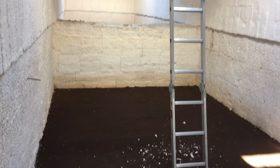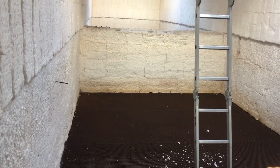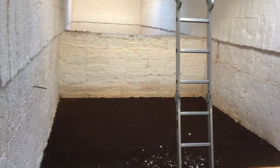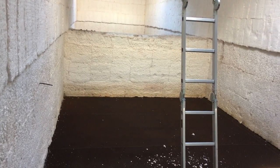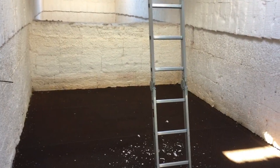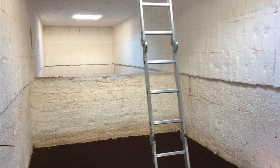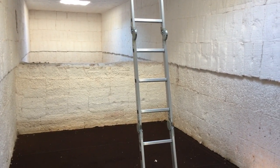In this bed, as you're looking, there's no ceramic media here, but right about that ridge along the width and length of it is where the ceramic media bed would be up to that level. It is the heat exchange media that absorbs heat — air in this one cycle would be coming up through this bed and would cross over in the combustion chamber area, which is pretty much above that ridge of insulation.